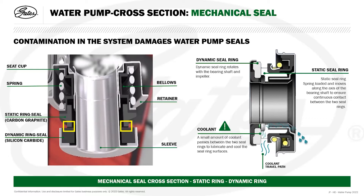We need a small amount of coolant to pass through these seal faces because coolant has glycol contained within the solution. Glycol acts as a very good lubricant and cooling aid for the mechanical seals. We have spring pressure pushing the static ring onto the dynamic seal, and also hydraulic pressure from the coolant forcing against the dynamic seal. The coolant produces a very thin film between the two seal faces, and the glycol keeps the seal faces protected.